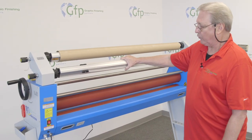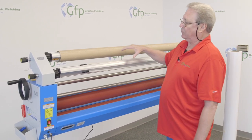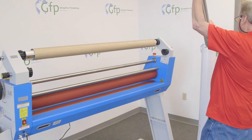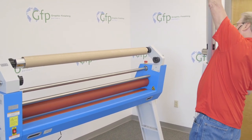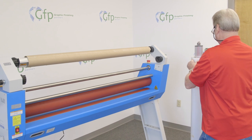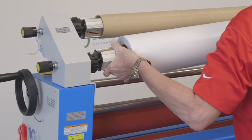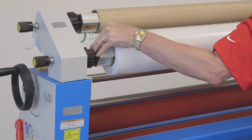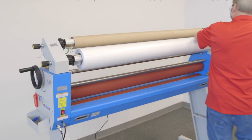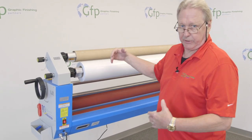This application is a PSA over laminate on a roll of printed vinyl media. The first thing I'm going to do is load my over laminate on my supply shaft. The next thing is to load the roll of printed media on the front side, line everything up, and get it threaded through the machine.